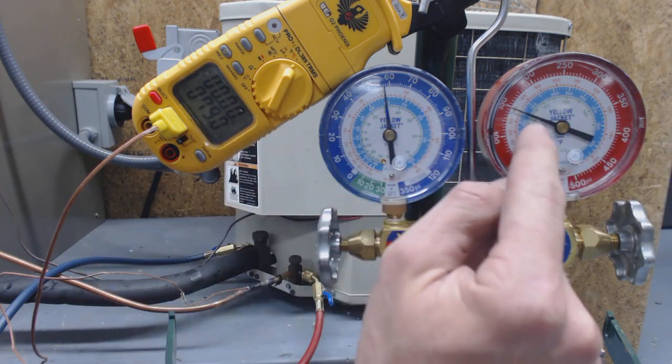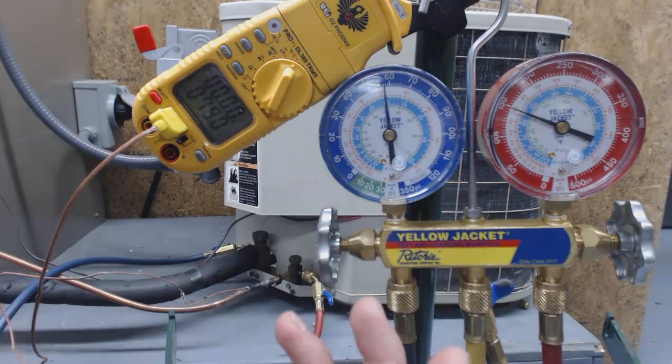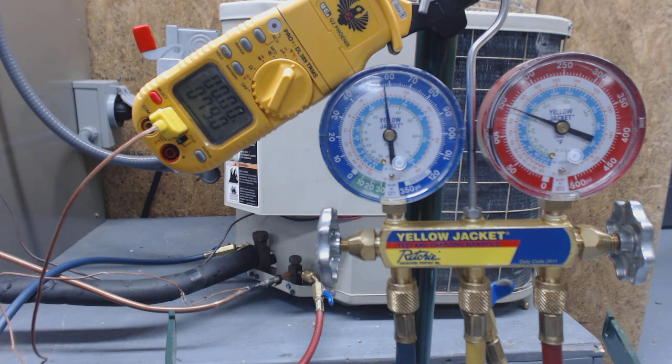Your actual temperature needs to be lower than this by about 15 degrees for this particular condenser. Most condensers normally call for 8 to 12 degrees of sub-cooling, then you're going to get ones that call for 13, 14, 15 — somewhere in that range. But you can find that on the rating plate.